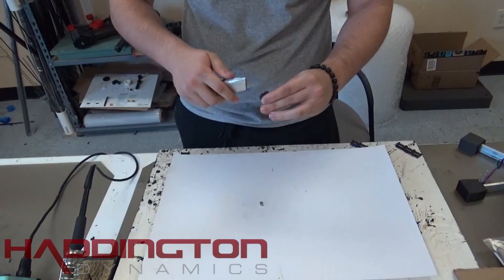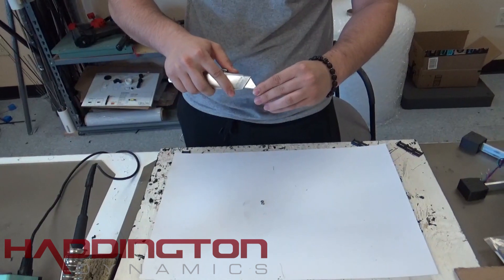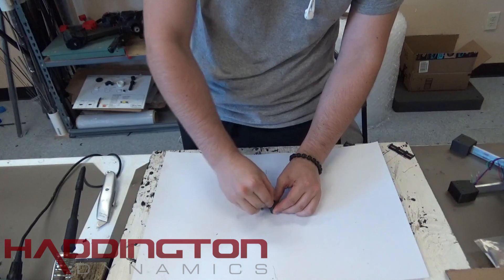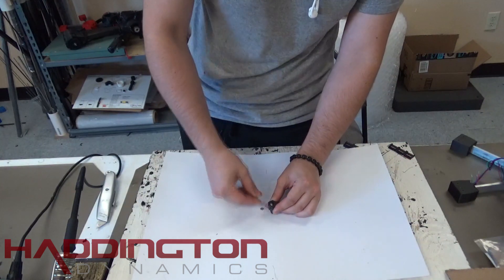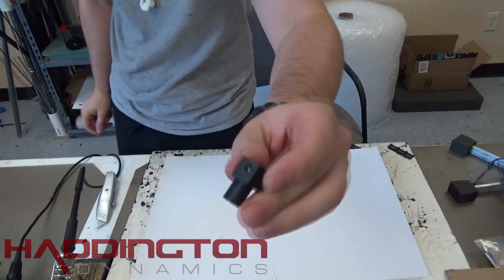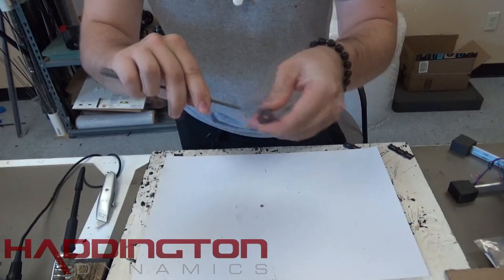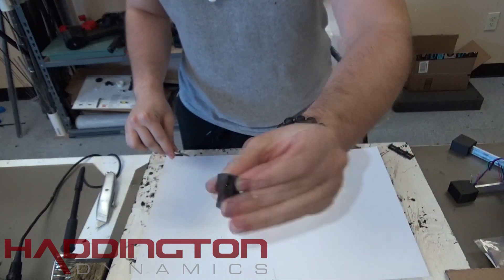Take your wave generator coupler and make sure there's no zero layer in the way of where the nuts go. If there is, just cut it out with a knife. When the spaces are clear, press the nuts into their spaces with the pointed side on top. You may not be able to get them all the way down by just pressing — to fix this, stick a sharp pointed object into the hole for the bolt and push it down from there.